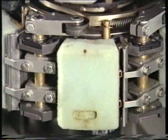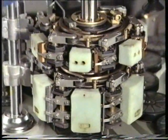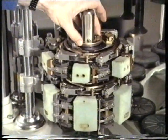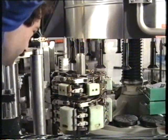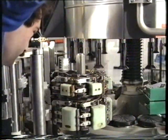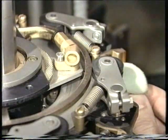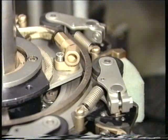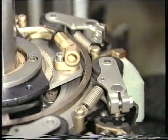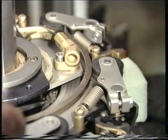Now to the shoulder gripper. The adjustments are basically the same as those for the body gripper. However, the shoulder gripper has an additional sponge pusher. For this adjustment, the gripper shaft, centering bell, and the main shaft of the machine are lined up. In this position, the roller of the sponge pusher should be at the highest point of the pusher cam. If this is not the case, the clamp is loosened and the pusher cam adjusted accordingly.